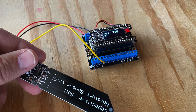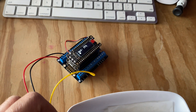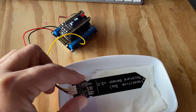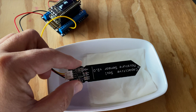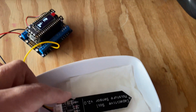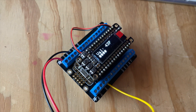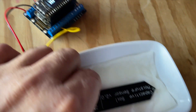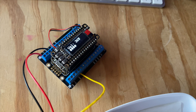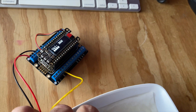Here's a video of the modified code showing how the sensor works. What I have here is the data logger running the 5-star rating system sketch, along with this capacitive soil moisture sensor. You can see now that it's dry. When I put it on a wet paper towel, I can start getting a response. Especially if I put my finger on it and push it down, I can get up to 4 stars, which is just shy of it being completely wet in a glass of water.